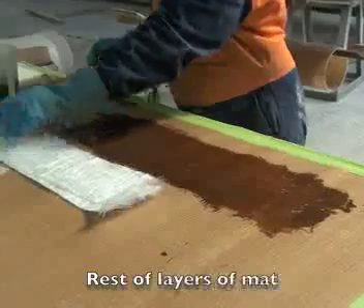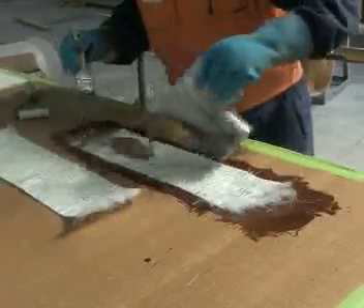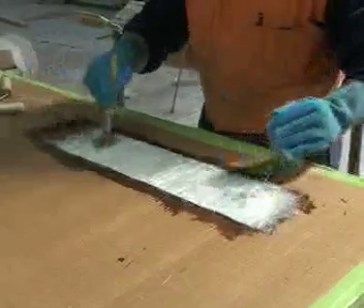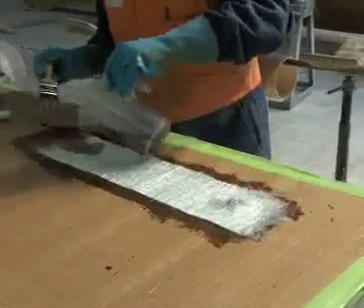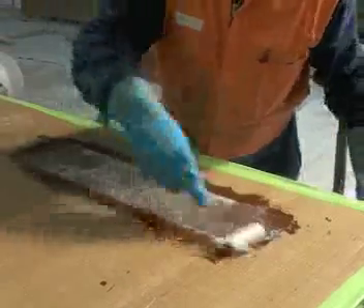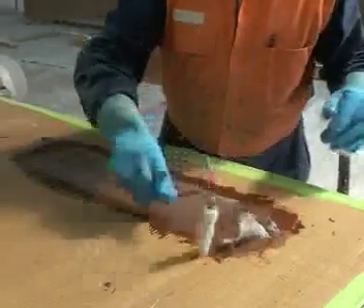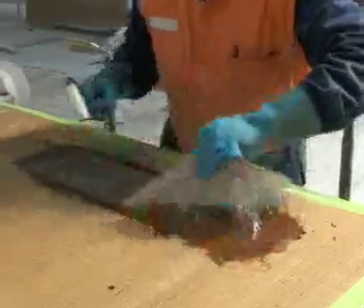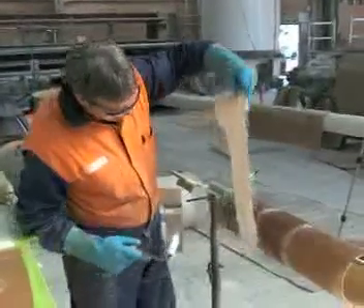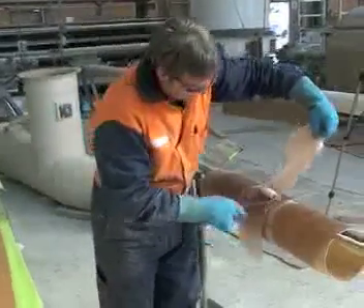This is five mat worth of strapping. Same process again — wet the table, wet your mat, push it ahead with your brush. Once again, stagger your mat. Roll the air out of it while you've got it on a hard surface, then pull it up. When you offer this to the pipe, start in a different place to where you did last time — that eliminates any build up.